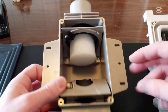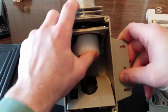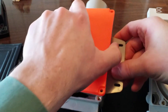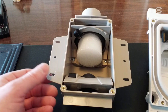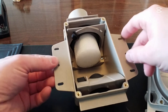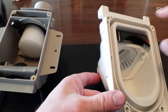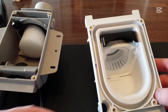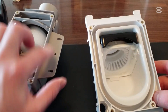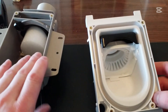The Chameleon box is a front-stud mount and comes with a plug installed to seal the piping off, and also comes with the plaster guard installed — you take this off for a retrofit or when you're ready to trim. The Hide-a-Hose uses a side-stud mount; you can see the holes, two on the left side and two on the right side, which eliminates any concern about the flange causing a bow in the drywall.